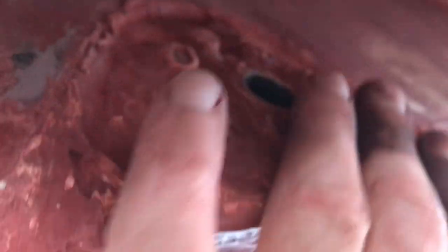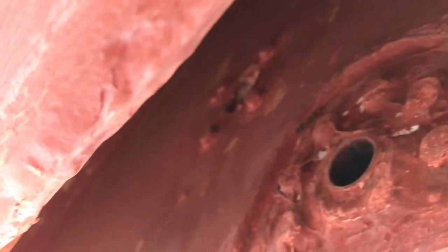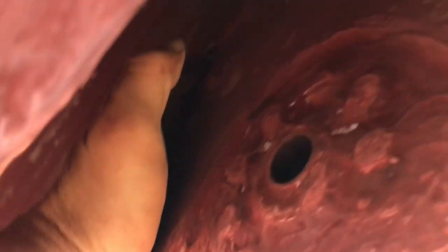So I have two options. I can put some 5200 or some other sealant just on top of the bolt heads, or I could put a little epoxy on there. And also up here, this tube for the plastic plug that pushes against, that could use a little epoxy or sealant.